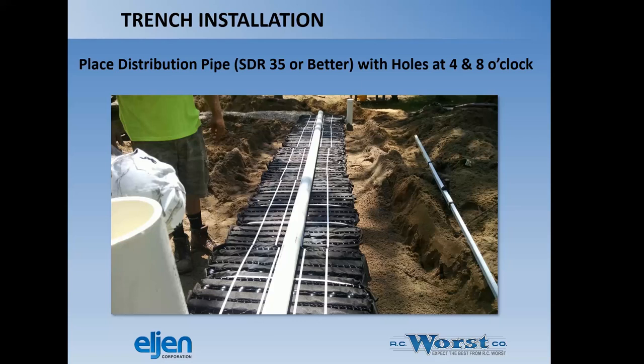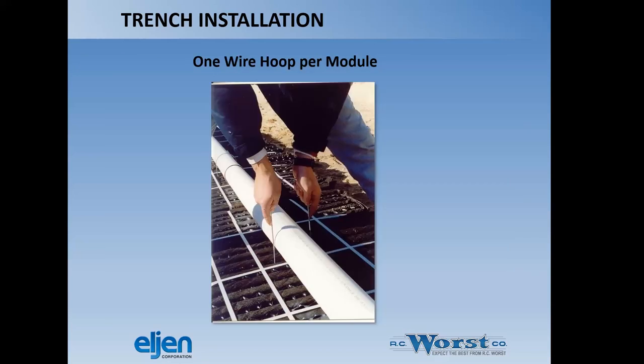You're going to want to place the modules in the trench with the white painted stripes facing up, and we'll talk about that more. So our perf pipe's going to go in with the holes at 4 and 8 o'clock. I think that's what I said earlier. And then we're going to put a wire hoop to hold those in place to make sure that they don't move around when we place the fabric over the top and drop some dirt in around it to hold it in place during backfill. Now, certainly these hoops do not go in after the fabric has been installed because we don't want to punch holes in the fabric. So make sure this is done prior to the fabric installation.